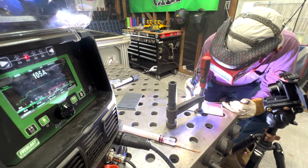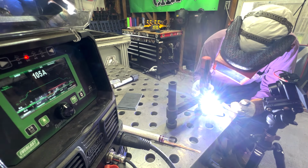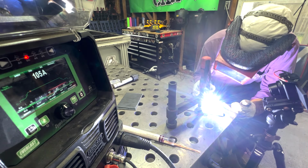We're just gonna move forward, feed a little bit of wire, move forward, feed a little bit of wire. Every time we're gonna pause, add wire. We don't want to lift our weld up too high. If we start lifting an arc up just high enough, you'll notice that it's much harder to make a weld go where you want. That arc is coned out too much. We need to tighten that arc length to have a little bit better success.